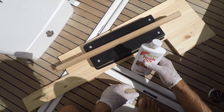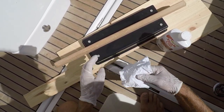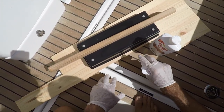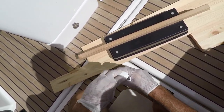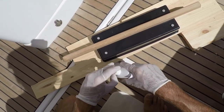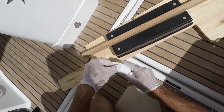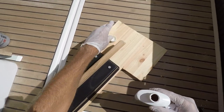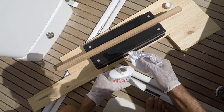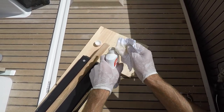We're going to go into doing a little teak oil. The teak oil is super runny — it's like water — so just be careful when applying it. It's really easy to over-apply. You'll probably see me drop a few drops on the teak floor, but it wipes out after a couple of weeks. I'm going to use a rag and wipe it on — that allows you to get the most even coating. I've already probably put too much on the rag so I'm going to wipe off the extra.